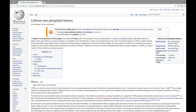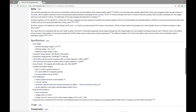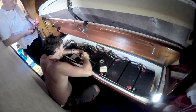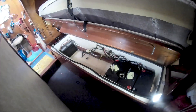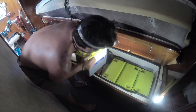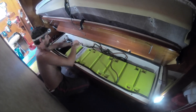After a lot of research, I found out that not all lithium batteries are created equal. Depending on where they're produced, you'll find different battery chemistries, production standards, and even testing. I decided to go with lithium iron phosphate — LiFePO4. These batteries have a slightly lower energy density than other chemistries, but are more stable because of it. Plus they're 95% recyclable. I chose batteries manufactured in the USA, which means they conform to strict quality control and testing standards. These batteries in particular are even certified for air freight.